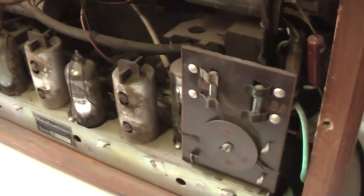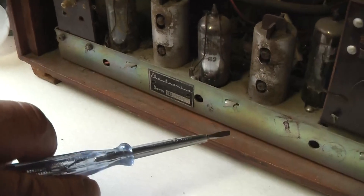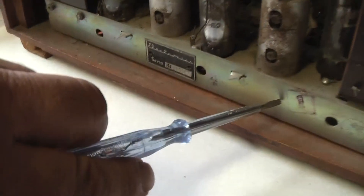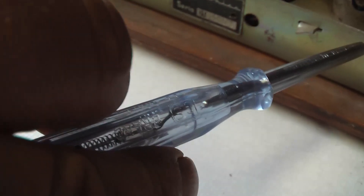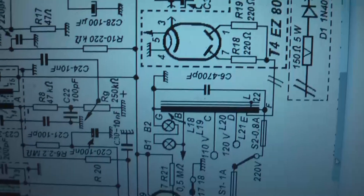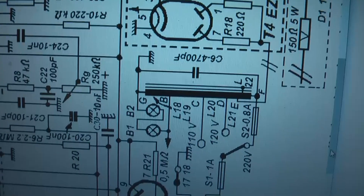I thought, well, what was that? The chassis can't be on mains live. But I tested it — and there, the neon lights up. The chassis is live. Although it's got a transformer in it, I thought, well, how can that be? So I downloaded the circuit diagram. And see there — look — it's an auto transformer.